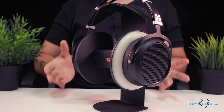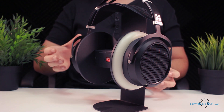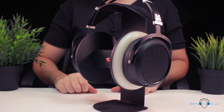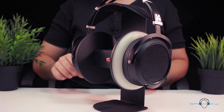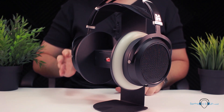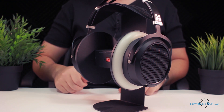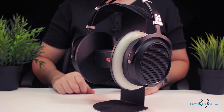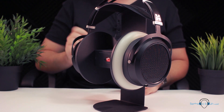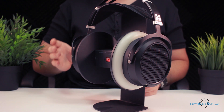Judging the value of the HE6 SE is pretty much going to depend on what other equipment you already have. Honestly, if your headphone amp isn't capable of delivering more than two watts of power, you'll really be wasting your time. There are very few headphones that require me to switch my iDSD Black Label into turbo power mode, but the HE6 SE absolutely demanded it — and even then I had to turn the volume knob up to the two o'clock position. This means you may need to factor in the additional cost of an appropriate amp, which is an unfortunate but inevitable side effect of using ultra-low sensitivity headphones.